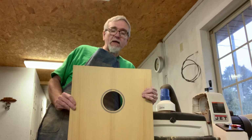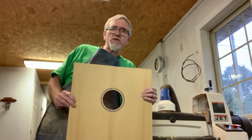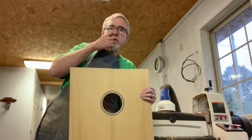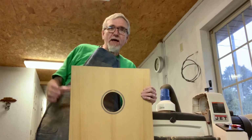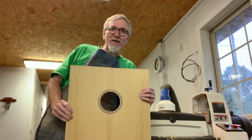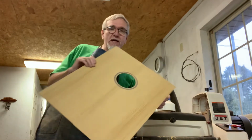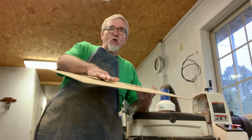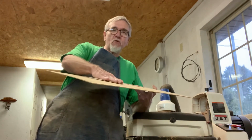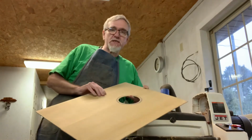You're talking about a lot of pull on a set of steel strings. I've heard 120 to 160 pounds. It depends on the gauge. You can look up the statistics on the strings that you like to use, and it may give you a whole new respect for that thin little piece of wood that is your guitar top holding all of that tension. And not only is it pulling, it's torquing the top, trying to rotate it this way. The bridge, of course, and the bracing on the top help it to resist that pull.